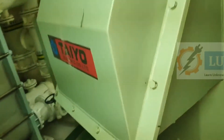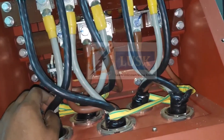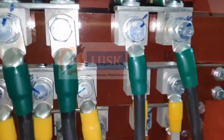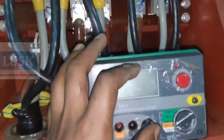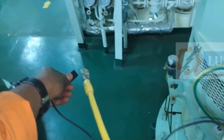Now we go to the motor side. Here I removed the motor terminal box — you can see there are more connections. I will explain how high and low speed connections are given in some other video. Here I am going to do terminal checks — I mean the tightness — with the torque range according to the manual, checking how much Nm with the torque wrench.